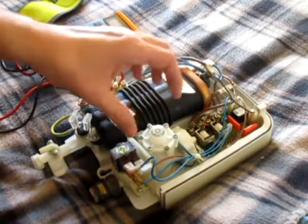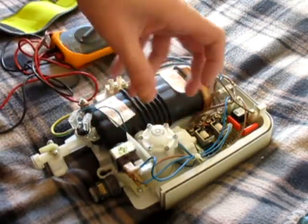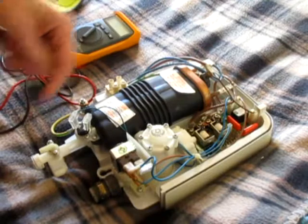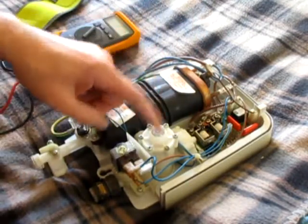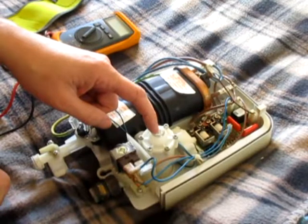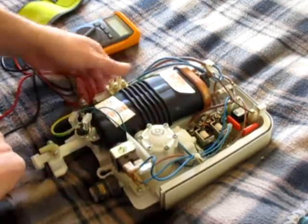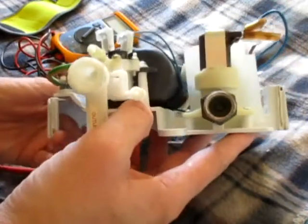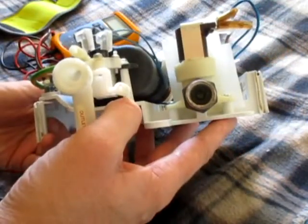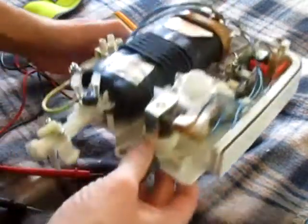...through this valve, which is basically like a tap that lets more water through or less, to control the time that it's in the heater. So basically if you're having flow problems, it could be that you have to strip it out, change the valves and the O-rings inside, clean it out. But also there's a gauze in there that can block up and cause flow problems as well.